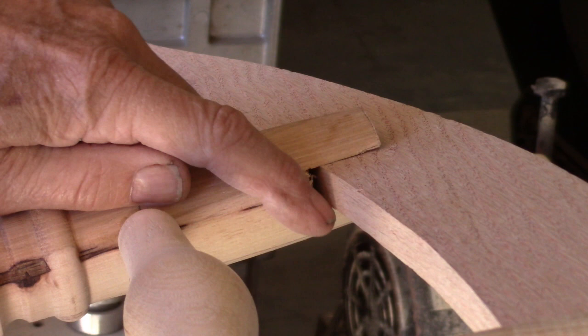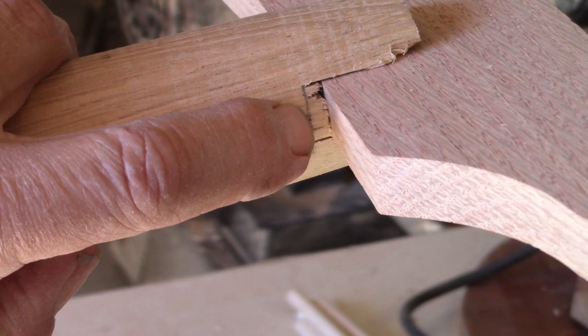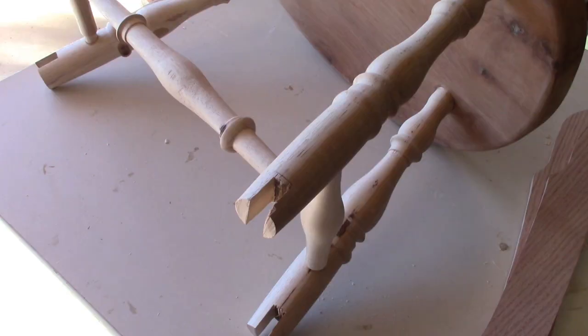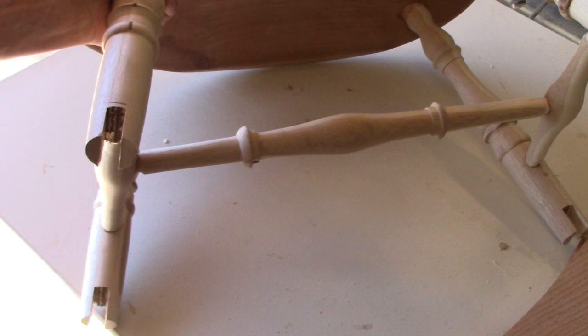Because the rocker has a curve and we cut straight, we have this gap, and that'll be on both of the legs. So if you look at the front leg, I have it marked here — we need to remove this much on the front, and the same happens to the back leg. Then that will give us a close fit. I'm going to cut a stop on the edges, then I'll take the rest out with the chisel.